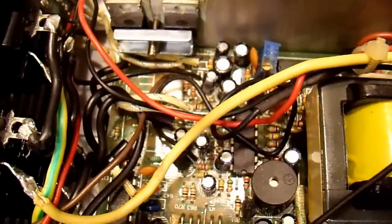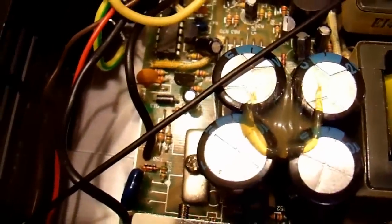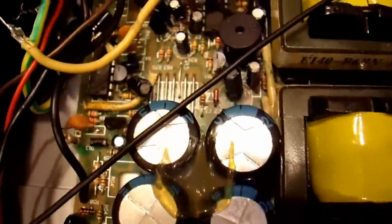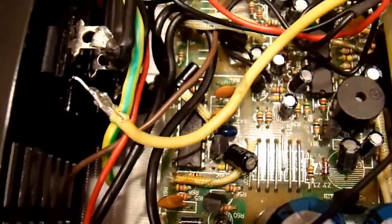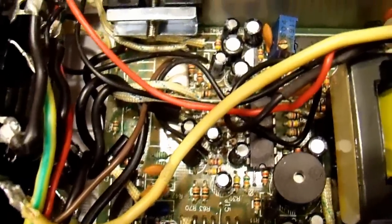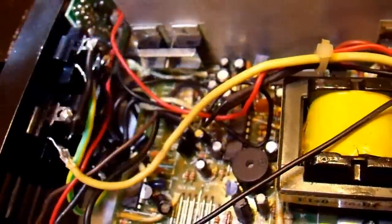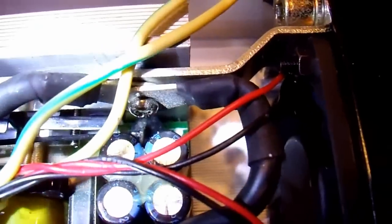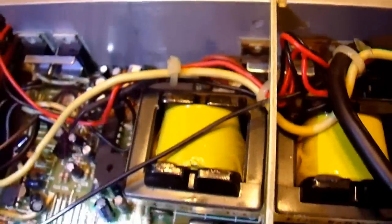It's obvious that this whole thing is hand soldered. The bottom might be wave soldered — I don't know, I'm not going to take the rest of it apart to find out, and I'm kind of scared to even look at what the bottom looks like. But hand soldered — you can see all of the point-to-point wiring on here looks pretty nasty. Over here we have a wire that's just hand soldered onto that diode, and all kinds of stuff that will probably just rattle off as soon as you give it even a little bit of vibration.